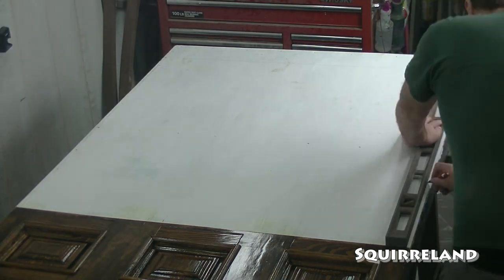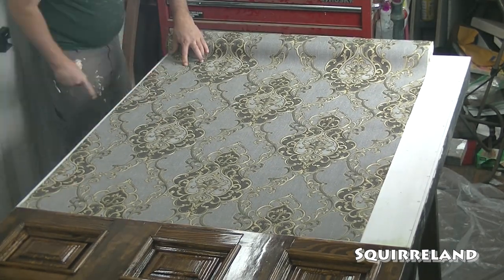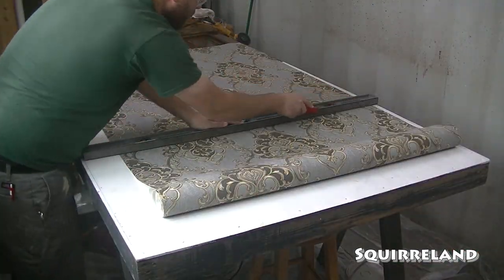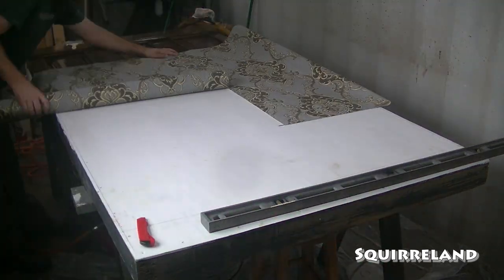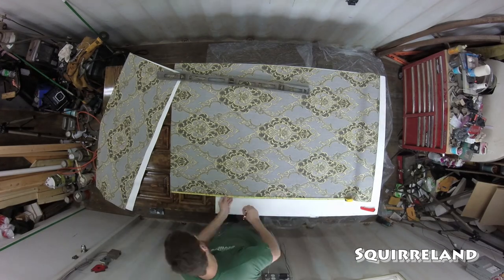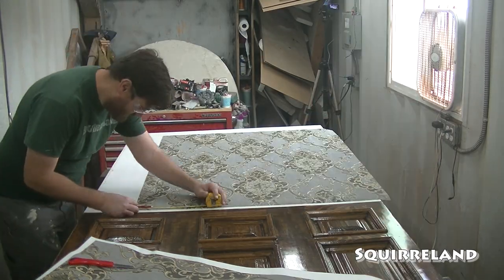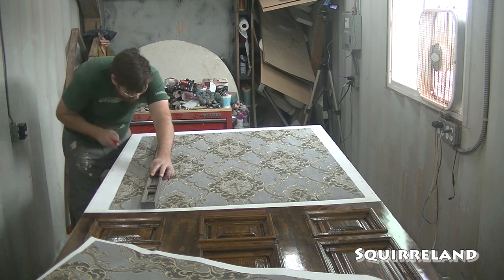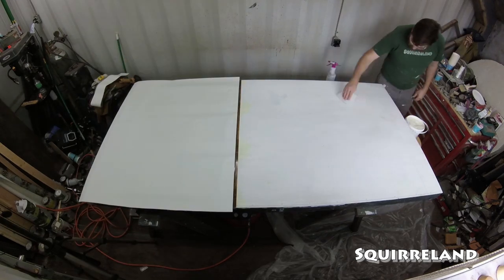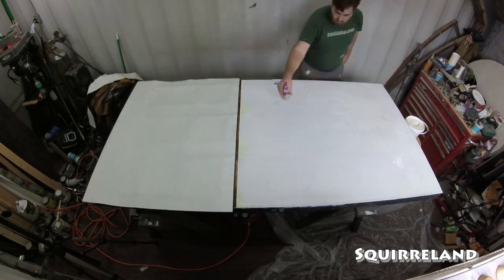Normally, the wallpaper I've used in the past has been what is called double wide, which is generally about 22 inches wide. The wallpaper I bought for this project is quadruple wide, which puts it about 44 inches wide. Which is great, but it unfortunately doesn't come as pre-pasted, which means that it doesn't have water activated glue already on it. No matter though, I have wallpaper glue and a plastic tool. I'm setting the wallpaper back about 3/8 of an inch on each side, and cutting it so that it will be underneath the chair rail and the crown molding — the idea being that I want the wallpaper to be held down by the trim boards. Hopefully this will stop the wallpaper from peeling up in the corners if it happens to get any moisture on it. I lightly sprayed the back of the wallpaper with water so that it would loosen up and be a bit easier to work with.